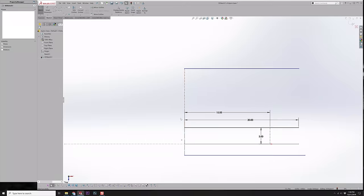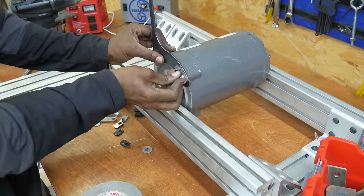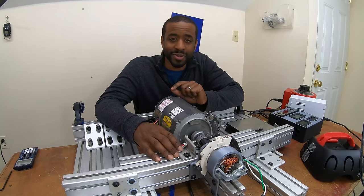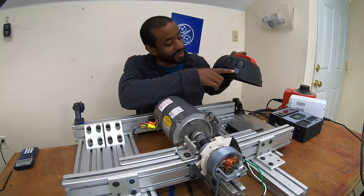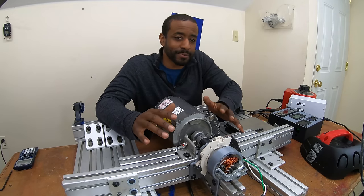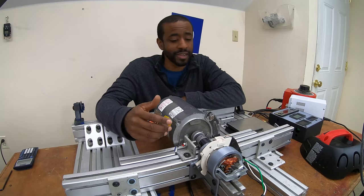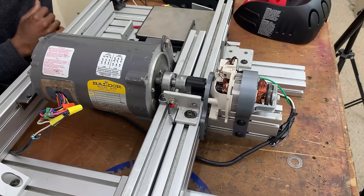If you want to see more details about how I built this rig or how to make one yourself, there's a whole video dedicated to this project — link in the description. All right, I think we are finally ready to test this motor for horsepower. There are a couple of variables we need to know. On the back of every electrical appliance there's a voltage and current rating, and we're going to use that because it should be the optimal performance range. Also, because this is a universal motor, I'm going to slowly dial up the voltage instead of just hitting it with 120 volts, otherwise it'll spin out of control and give us a big spark show.